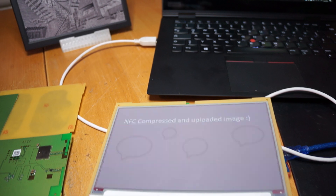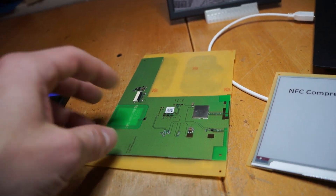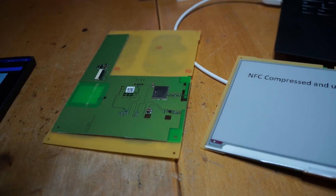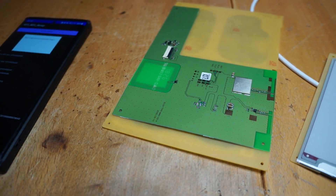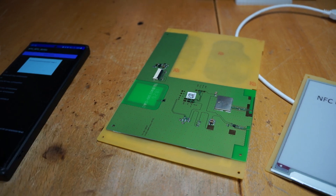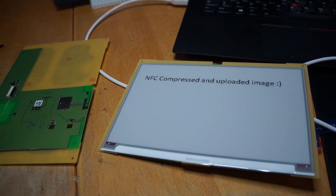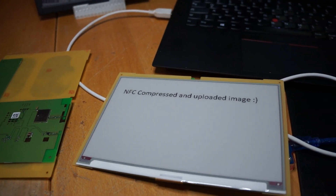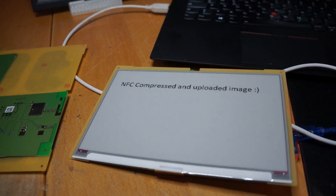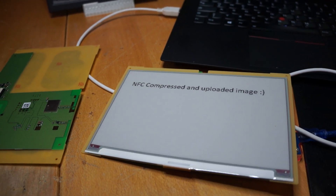This was quite troublesome because this NFC chip is normally just a tag — you could read it all the time even if the battery is removed. Normally you would have NDEF records like a URL, hold your phone to it and it opens a web browser, or store Wi-Fi credentials. But it also has a pass-through mode. It's an NXP NFC chip and this is quite hard to handle as the status is a bit back and forth. It uses the interrupt pin to communicate which status the pass-through RAM is in. I was able to implement it so it works flawlessly and quite stably.